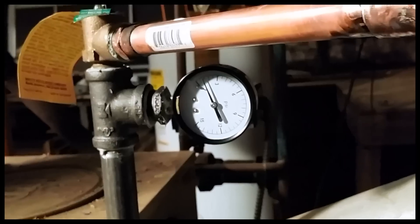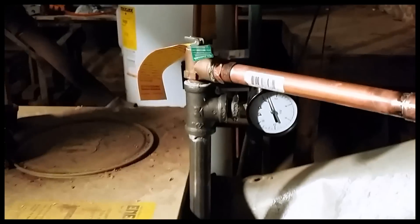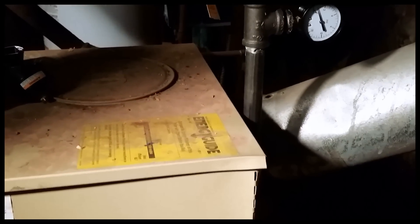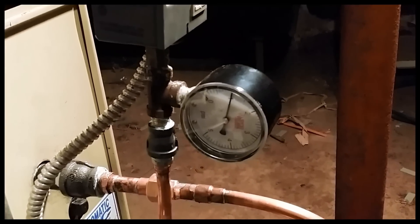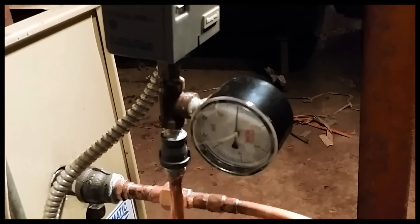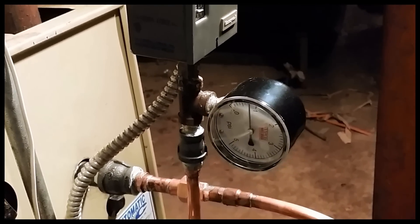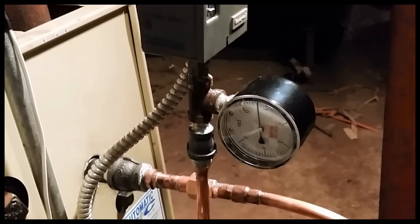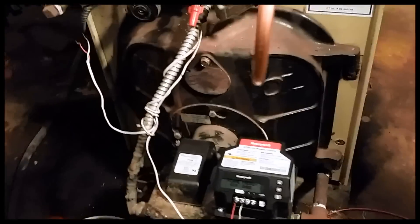You need the bigger gauge here because there's more pressure here. The pressure will be the same — that one theoretically should be pegged. The thermostat still sits at 70 and it's 62 in the house, so it should call for heat and kick back on when it drops to one pound. It's dropping fast. Look — it's going to kick on any second. At one pound it should kick on. We set it so who knows. The differential is one. It goes back down to zero. Three quarters of a pound — nice! It won't blow anymore!